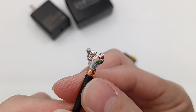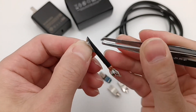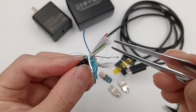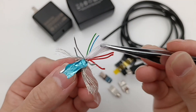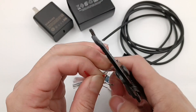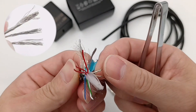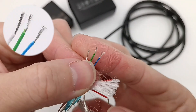Next, let's move to the cable and check what's inside. A layer of shielding is under the black outer skin — this is the tin foil. Separating all the wires, the tensile fibers are in the middle, which can improve the tensile strength of the cable. Taking a closer look, three red wires are connected in parallel to positive, three bare wires are connected to negative, and here are the white, green, and blue wires.